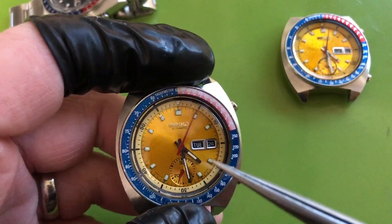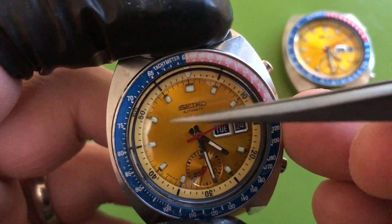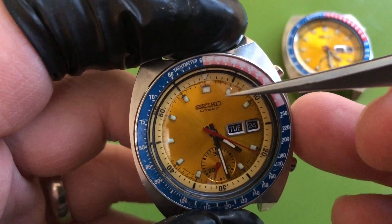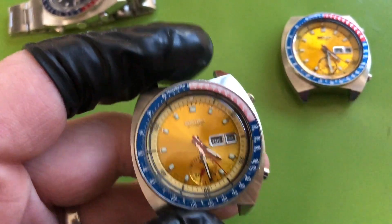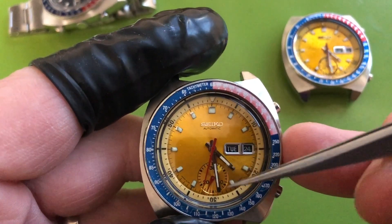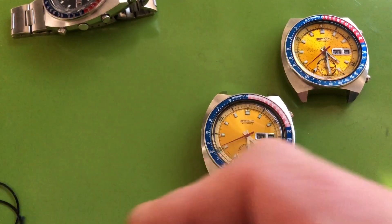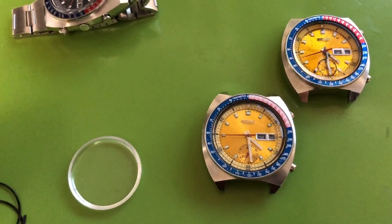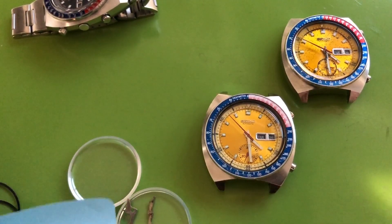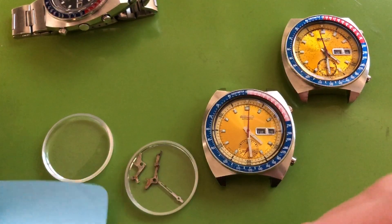I had to make sure all the case and sealing surfaces were as they should have been. The loom was pretty bad on this dial, which is a shame because the dial surface itself was great. I was able to save your original dial loom with my Revital-loom — I lightened it up and cleaned it. It's still toned down a little bit, not bright white, but it's good. This is an original handset — good used — with original loom to match the dial, because your original hands were junk. The moisture, heat, and time just steamed off the plating. There are your bad operating levers.